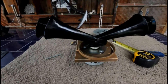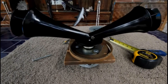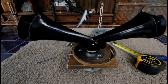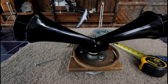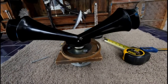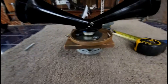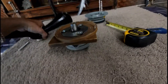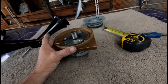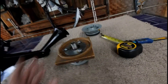I'm redoing a Leslie 900, converting the solid-state amp over to a 100-watt 2-channel Yamaha amp, all 8-ohm, with a new driver. That's it. Hope this helps somebody out — took me about 45 minutes to make this, no big deal.